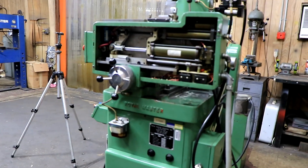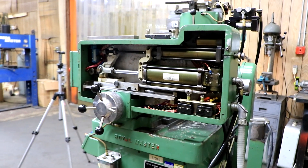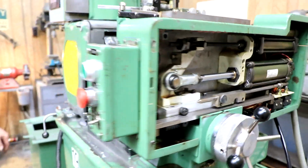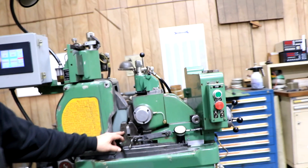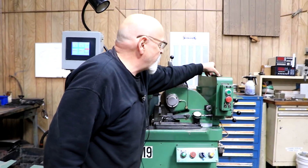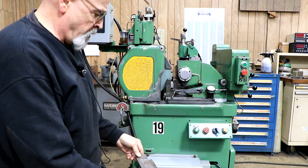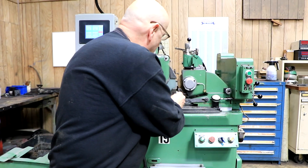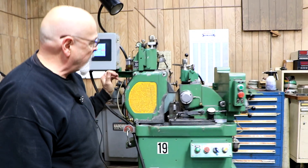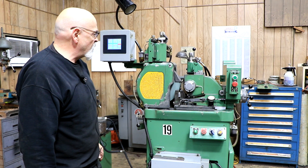Back here is your in-feed unit or mechanism — we'll go over that in a couple of minutes, but I'm going to show you a cycle first. Right now this machine is set up for in-feed grinding. This is the in-feed grinding work rest holder or tool holder. You would normally have work rest blades made especially for your part, ground for your part, ordered from Royal Master. The part rides on top of a very thin carbide blade that rolls the part into the regulating wheel, which keeps it spinning, and it gets ground by the main grinding wheel.